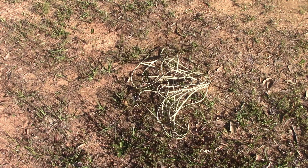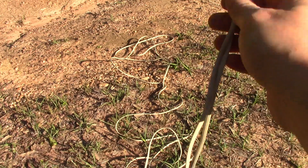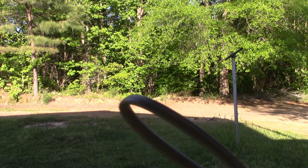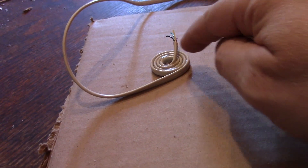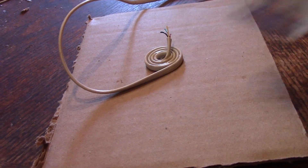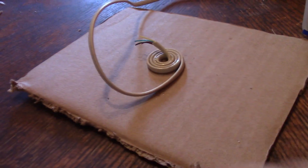First thing, let's get the coils made. About 20 feet or 6 meters of old telephone wire — I'll cut it into two matched lengths. I'm not sure how many turns that'll be, but they will both be equal as matched coils. I've made the first turn, stuck it onto cardboard, then every turn or so added a bit of superglue, just winding around and around keeping it flat against the last turn. That's how I'm making each coil.